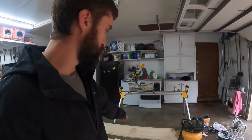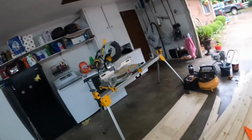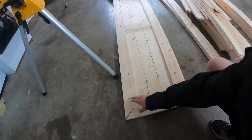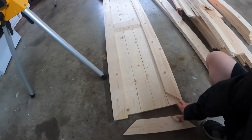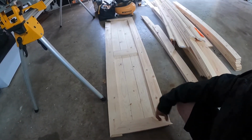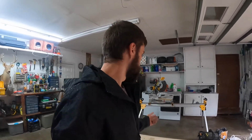But we're gonna get started building shutters. Basically what I'm doing is going 5 wide, and then we're stacking on the end one, cutting 45s, and then we'll have this, and then there'll be a center board right there. And then once again, everything's in storage. I wish I could find my Kreg jig, and I'd bring all those boards together. Some of them kind of got bows, and I'd bring those bow spots in with my Kreg jig. I can't find it anywhere, so hopefully I can just kind of squeeze them, glue them, and we'll call it good for now. But let's get going.